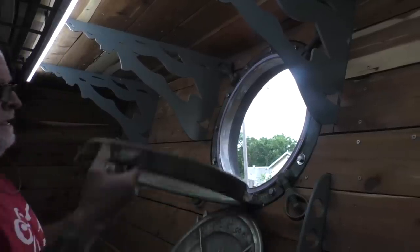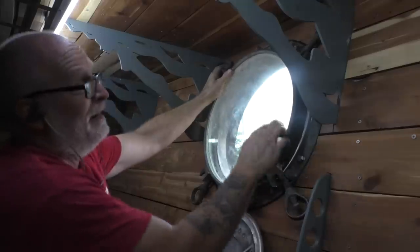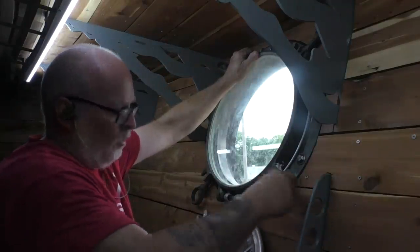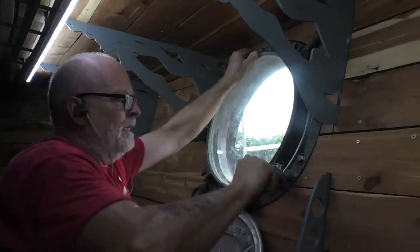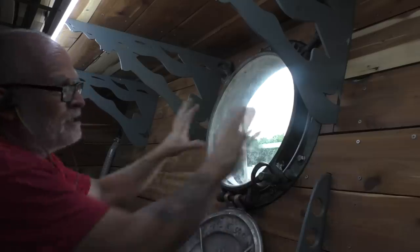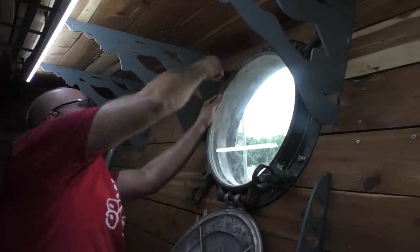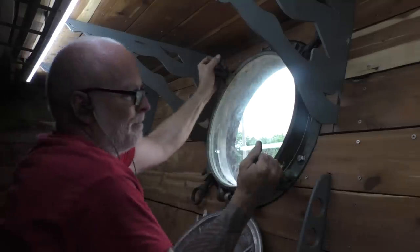Work because this is the piece that seals into the silicone. It's got a nice edge there. I have to make sure that they actually fit. And then there are four dogs that can hold that part down. You only need to close a couple of them. And the hinge needs to be sloppy so that the window can actually fit into the rim. That way it seats nicely into that gasket. So if it's got a leak, that'll be the problem.